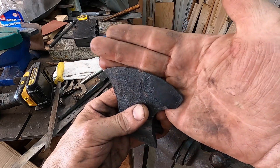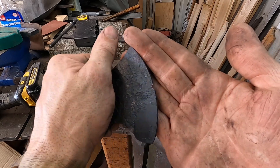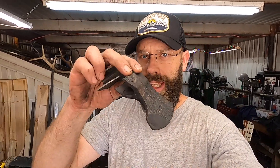This hatchet bit has been austenitized and quenched and should be hardened. If the steel has any appreciable carbon content and has been hardened, the file should not dig in. You might say I just messed up the heat treat, but I double-checked it – I've heat treated axes and knives before, so that really was not the problem. Those five mini carving hatchets now all look like junk.